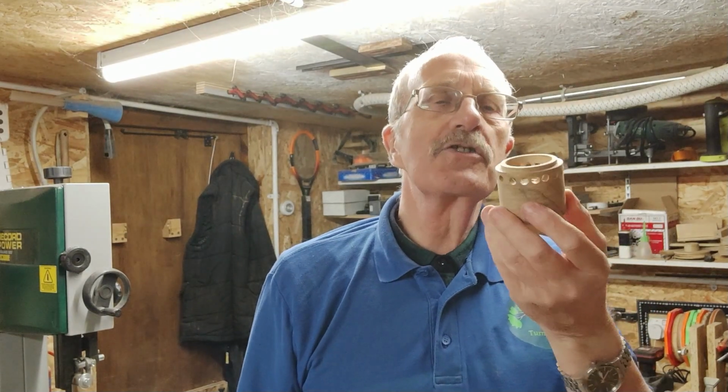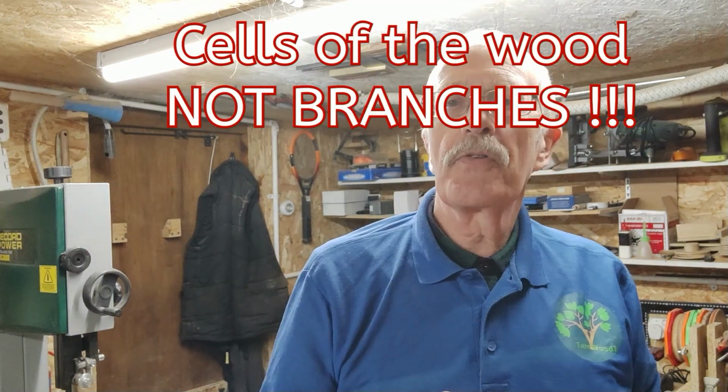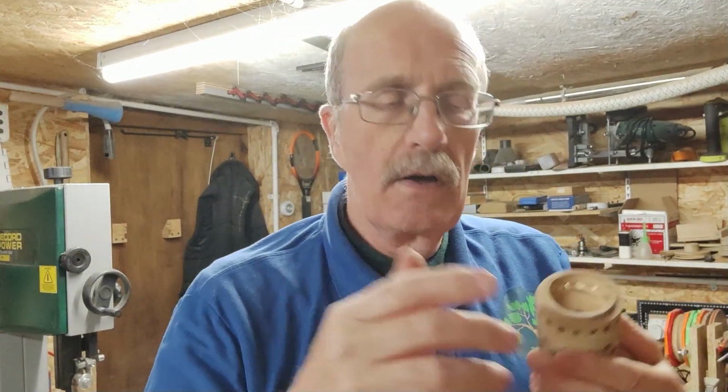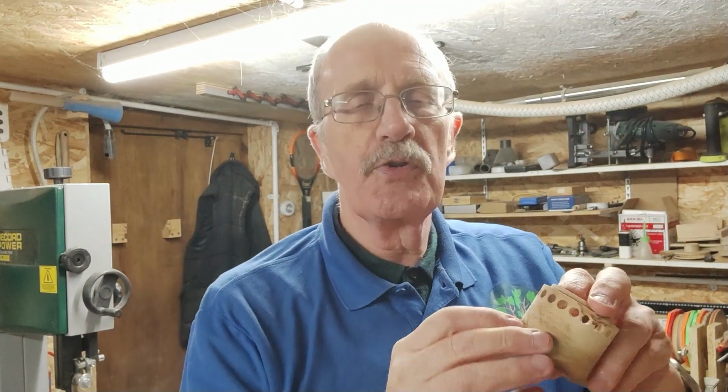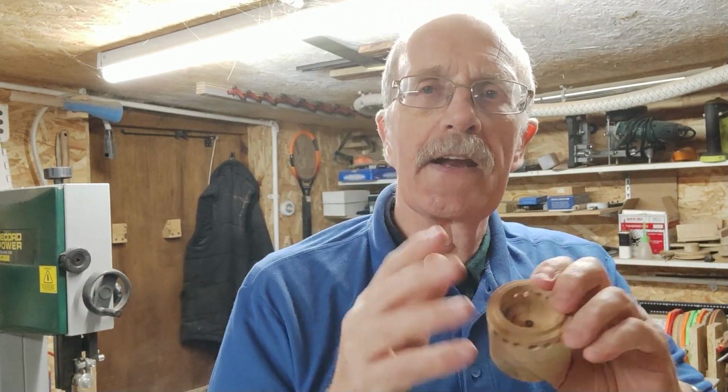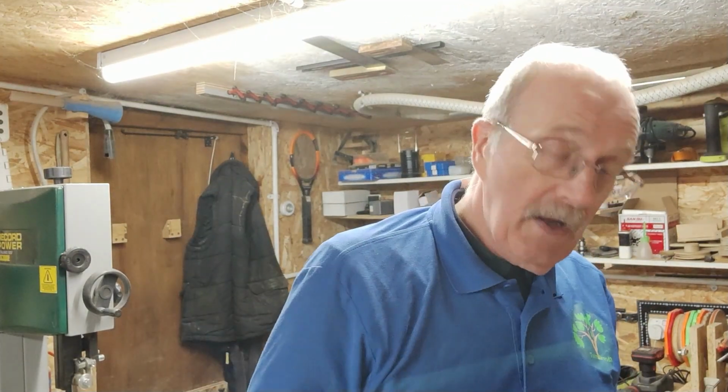So the wood that we're going to use today is spalted beech, which is what we call a punky wood. It's been allowed to rot in the ground, and the fungus has formed on the end grain and worked its way up through the branches of the timber, which can leave a very attractive feature. The lines produced by the fungus look like pencil marks, and the changes in colour of the grain can be quite distinct, and changes in overall colour as well. It's a very attractive wood when you put a finish on it.